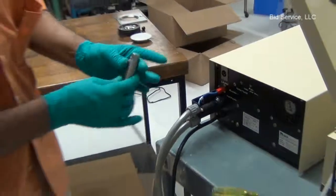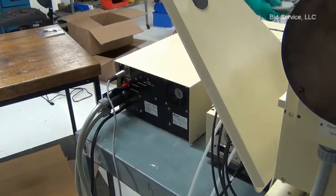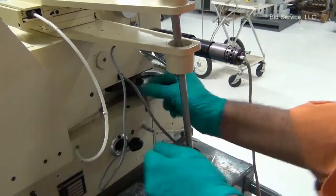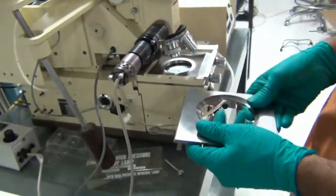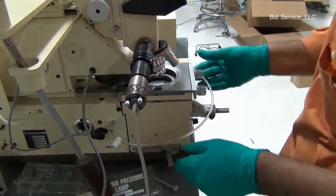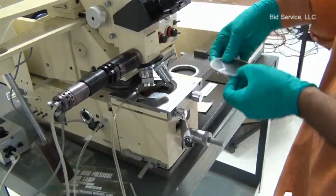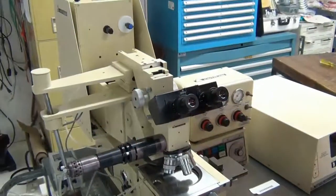This is the lamp intensity feedback — connect the connector. I am going to slide in the condensing lens. The mask holder frame slides in here, as I already demonstrated. Connect the mask vacuum line using the barbed connector. And here is the substrate holder. Everything is now installed.